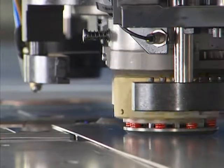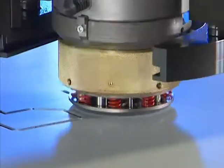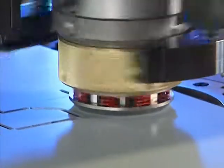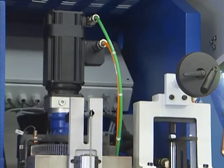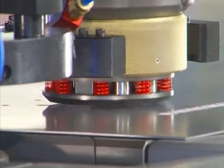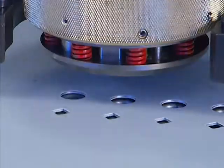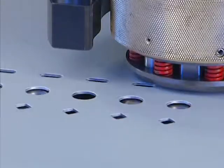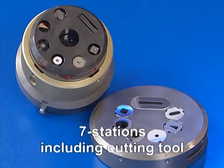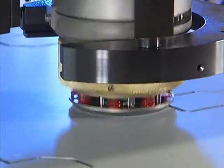For the production of more complex parts, we recommend the CombiCut Rotation Index series. This series allows a stepless rotation of 360 degrees for all tools up to diameter 105 millimeters. The rotation is activated with two brushless DC motors and is controlled separately on the upper and lower side. This maintenance-free system guarantees a positioning accuracy of 0.03 millimeters. The indexing of the tools in the Revo tool is automatic via a pneumatic fixing pin to the Revo tool gear wheel. For this series, we designed a seven station Revo tool. In addition to the six tools with a maximum diameter of 16 millimeters, a 5 by 30 millimeter parting tool can be used for cutting almost all contours, making it possible in most cases to work a complete sheet without tool change.